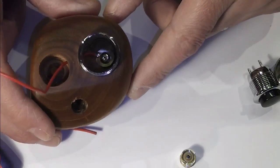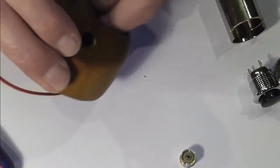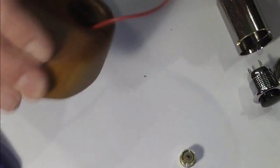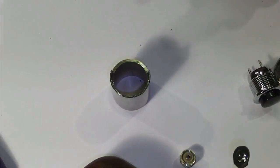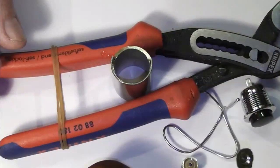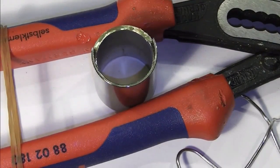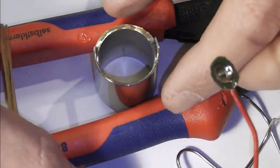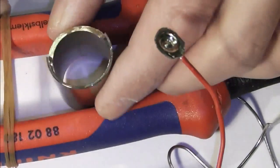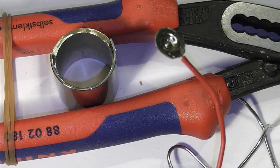So it sounds like we've got a plan of sorts. I'm going to leave that with a little bit out, feed it back through. And what I need to do next is test to see whether my theory on being able to solder this up has worked by taking off some of this surround. Now I need to work out roughly where that's going to go. My channel's over this side, so as that slides in, I'm going to take it off pretty much this edge here. So let me just see if we can get some solder down on there.